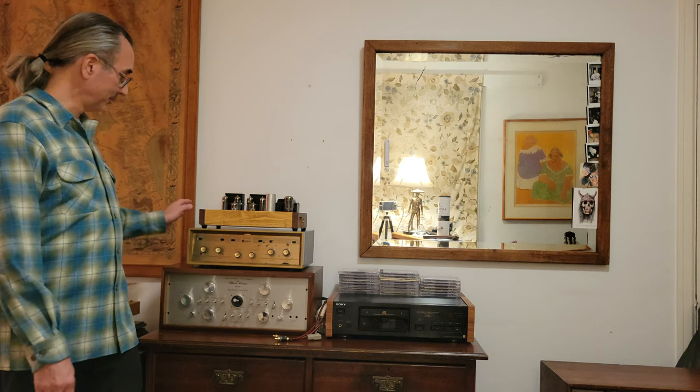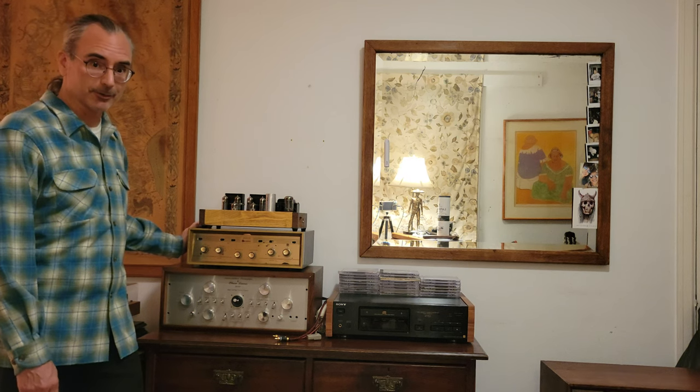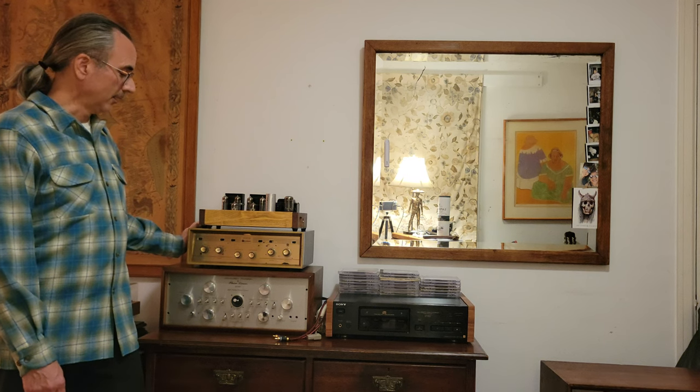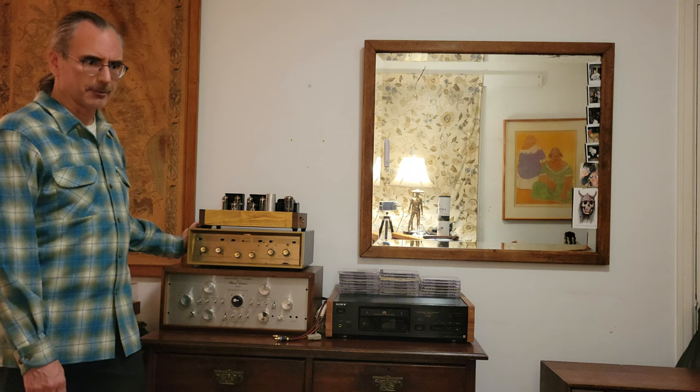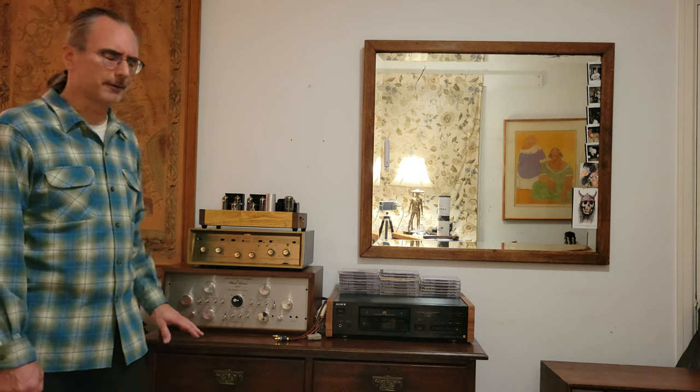Anyway, doing a recap on the PACO, I didn't change all the resistors in there, but I changed the vast majority. And I changed almost all the capacitors. The only capacitors I didn't change are ones that are bypassed in the current setting anyway. And it's made a huge difference. It was basically defective before. Really, it was defective with the capacitors and resistors that it had.